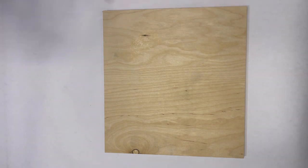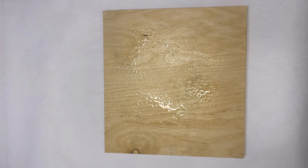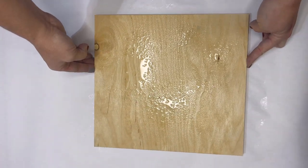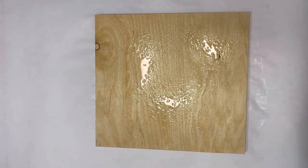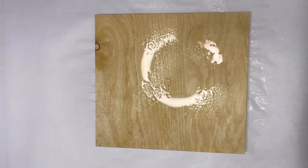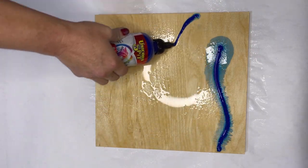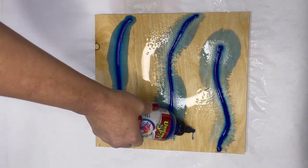I'm going to show you on this piece of wood. The first thing you do is take your bare wood — you could do this over existing finish too, but I like bare wood because it gives a more three-dimensional effect. Go ahead and get it wet with some water, because Unicorn Spit comes in the concentrate and it also acts as a wood conditioner, which is really nice.